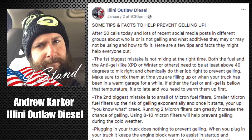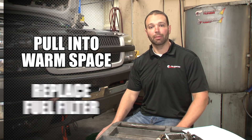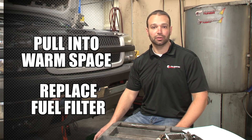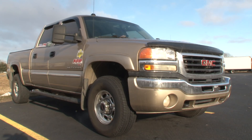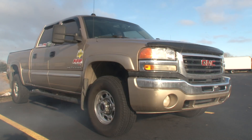If you get in a position where your fuel is gelled up, the best thing you can do is get that thing into a warm building, get it warmed up — it'll probably come back to life. If it's still cold and you're trying to resurrect it, you're probably going to have to change the fuel filter. Start it, if it runs great, let it run a while, at least so all the fuel in the lines can go through and you know you have good circulation in the system.